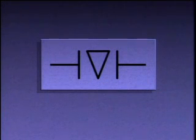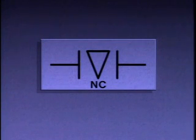On a piping diagram, the symbol for a plug valve generally looks like this. If the symbol looks like this, or has the letters NO beside it, then the plug valve is normally open. If the symbol is filled in, or has the letters NC beside it, then the valve is normally closed.